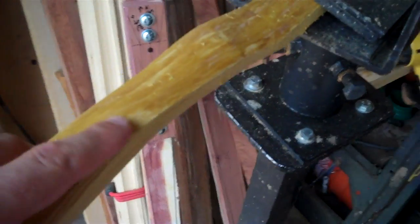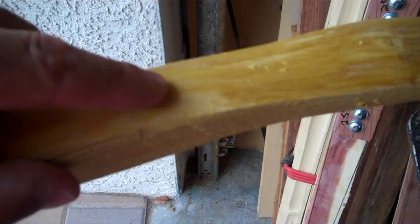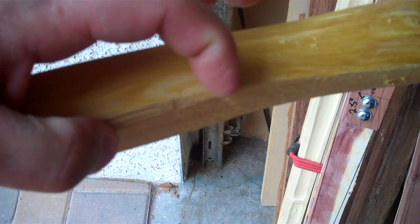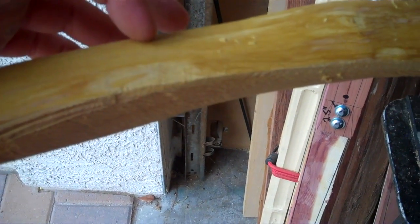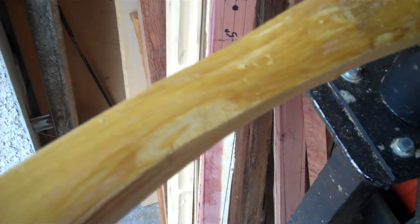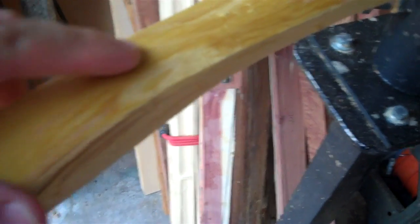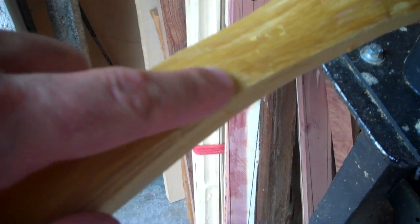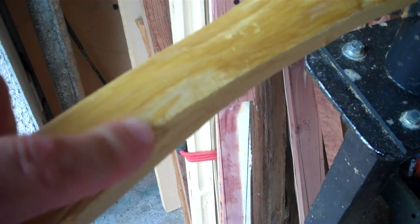But let's take a look. Sometimes it can't be helped. In order to get the lacquer off, you're going to break through a growth ring, as is the case here. Now you can see — here's one growth ring, here's what I've always called the spongy layer. It's actually early growth and late growth, but I still like calling it the spongy layer because it looks like a sponge to me and people seem to understand it better. Here's the ring, the sort of white spongy layer in between, and then the new growth ring that lies beneath.